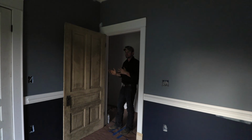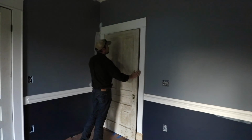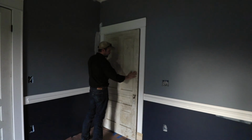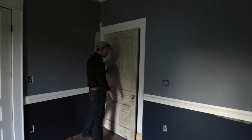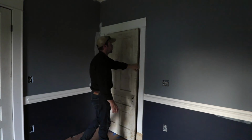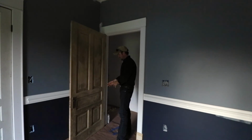We could show you on some videos where we ran into issues with doorways and how we fixed them. And hopefully as you work your way through some of these problems over time, the doorways will get easier and easier and easier for you. But the basic problem that you'll have is when you close the door, a lot of times the door will pop back out. And you can watch the hinges and see where it's binding and see which hinge is causing the problem. And then you just kind of have to open and close the door several times and watch that hinge and see if the hinge is set too deep, if you need to shim it out.